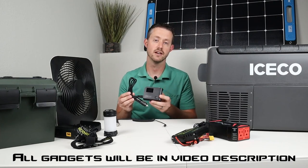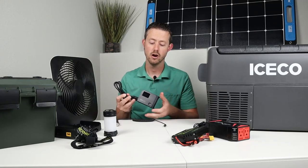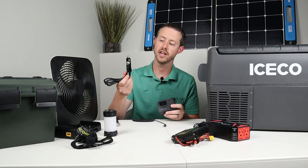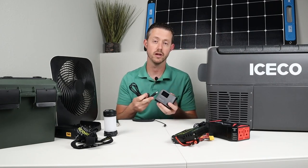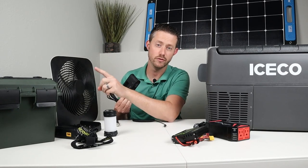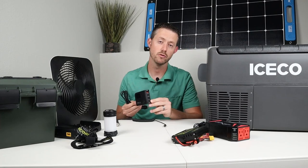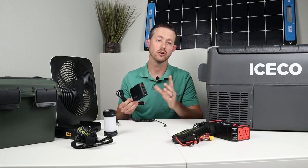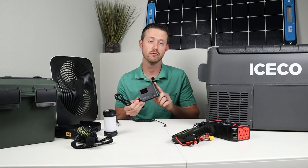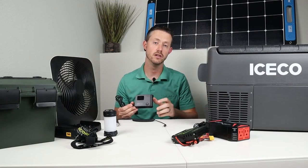Now this takes a DC input, so like 24 to 12 volts, so solar panels or even a battery like this. It has this 12 volt to 8 millimeter plug that comes with it, or a solar panel that plugs in 8 millimeter. Now what's nice is this does not have USB type C power delivery, but this will do USB-C power delivery 45 watts. So I could charge a laptop or a tablet that supported power delivery. I will do a future review video on this because this is an awesome charger along with my XTAR SP100